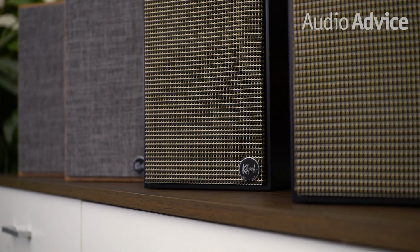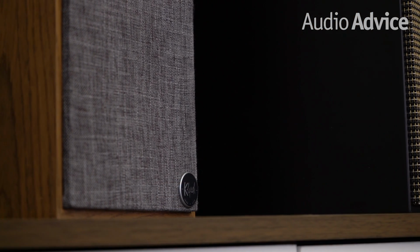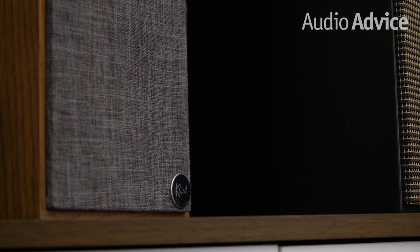Most powered speakers simply send a full range signal out of their subwoofer out, but do nothing to the main powered speakers when you connect to a sub. When you connect to the subwoofer out on the 5s, they actually kick in a crossover that takes the bass away from the 5s and sends the deep bass to the sub. When you do it this way, the mid-range gets even better since the woofer's not having to go as deep and move as far.